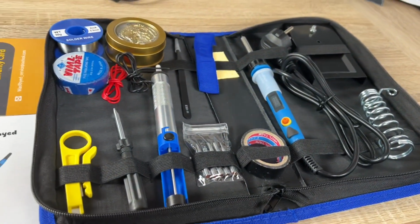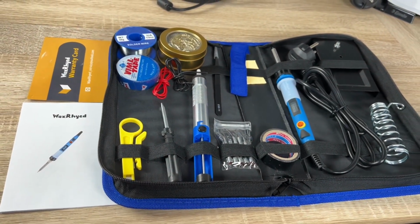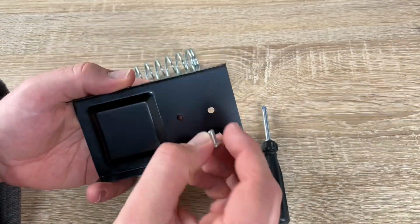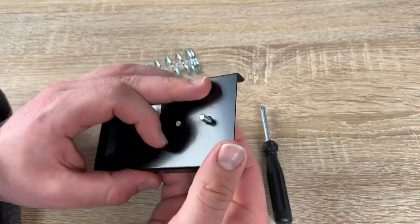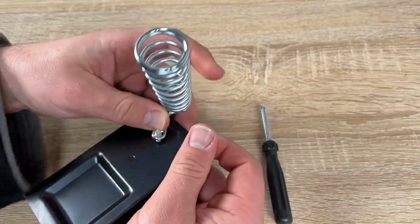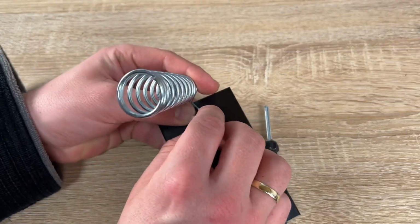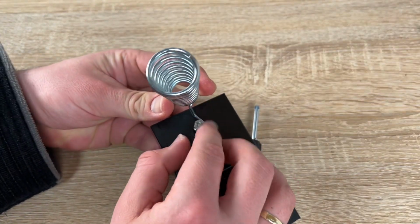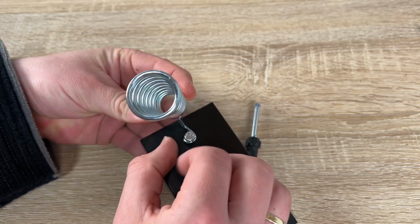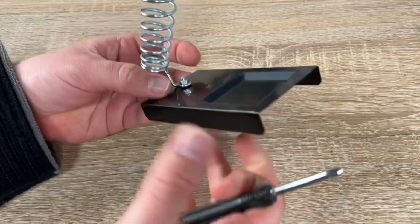The LCD soldering iron set comes with an equipped awesome LCD display, which allows us to see the current working temperature at a glance. The temperature can be adjusted by turning the temperature control knob, range from 200 degrees Celsius up to 450. Each time the knob is rotated, the temperature is raised or decreased by 50 degrees Celsius, making the time to reach the preset temperature shorter.